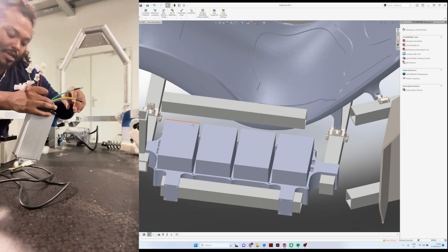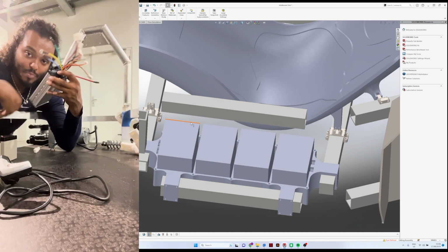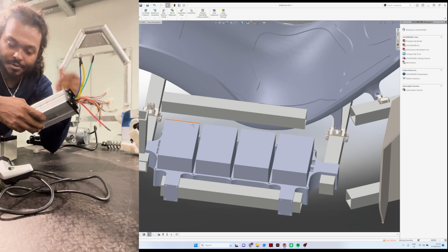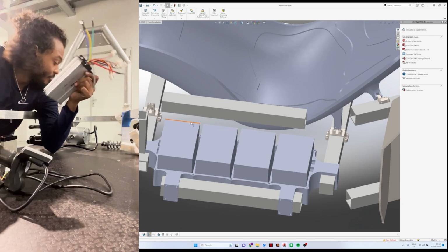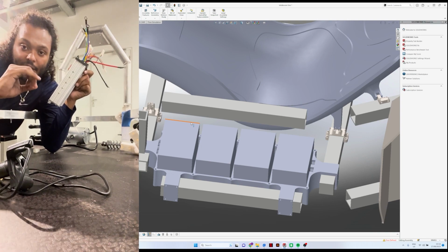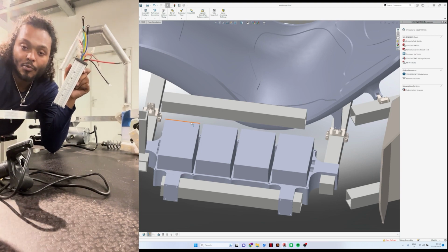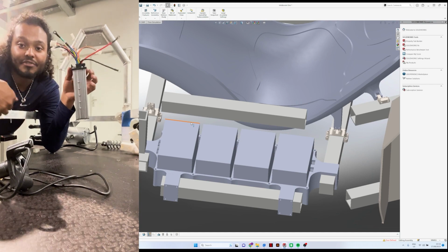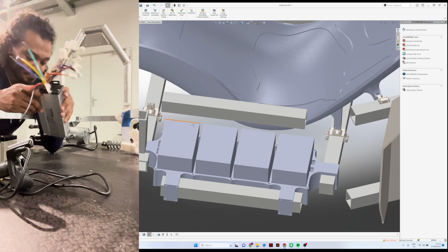As soon as that signal gets sent through from the throttle, the computer knows how much power from the battery it actually needs to send through the motor to get that done. But before we send the signal on how much power we need from the electrical system, we're going to place one more rotating sensor on the steering rod, so that as soon as you put some rotation into the steering wheel, we can also adjust the power for the inside corner, whether you're steering left or right.